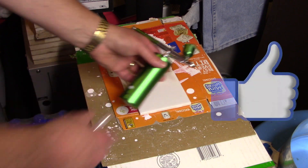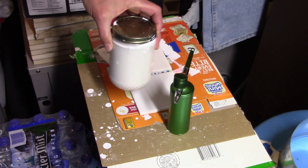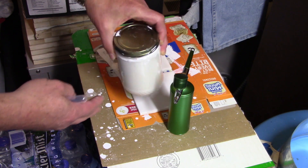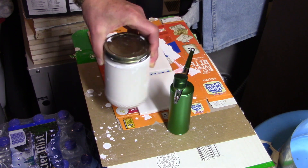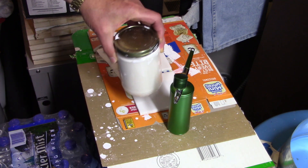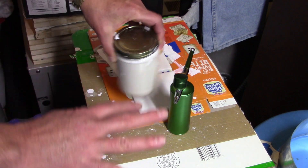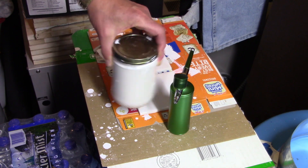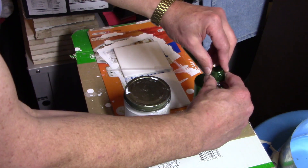Let's get this filled up with some titanium dioxide mixture. First I'll take my titanium dioxide mixture and just start stirring it up - swirl it around and let the denatured alcohol pick up some of that titanium dioxide. This is a suspension, which means the denatured alcohol holds the titanium dioxide for a while, but when it sits, it all settles down because it's not dissolved - it's just floating around.